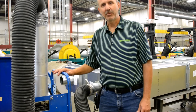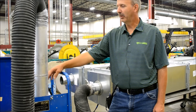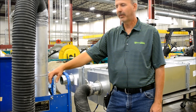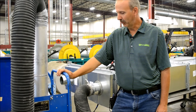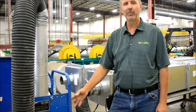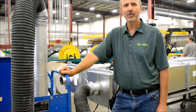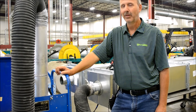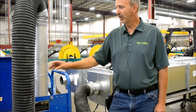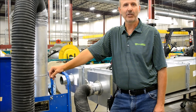This is a duct leak test rig that consists of a blower and a test tube that has a calibrated certified orifice plate in it. The first step in the process will be to energize the fan, open the blast gate of the fan until we get the required static pressure in the system to be tested, which in this case will be two inches. Once we achieve that, we'll measure the differential pressure across the orifice plate and calculate the actual leakage.